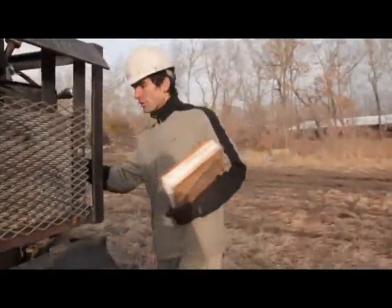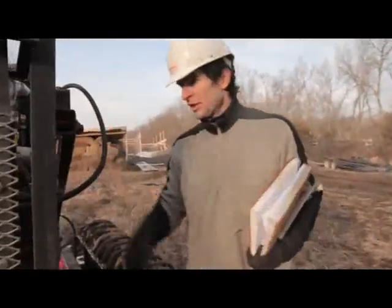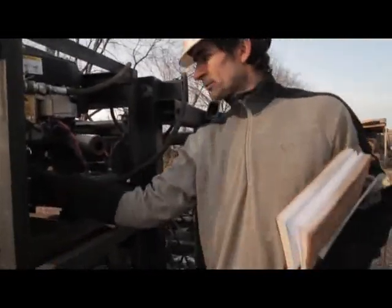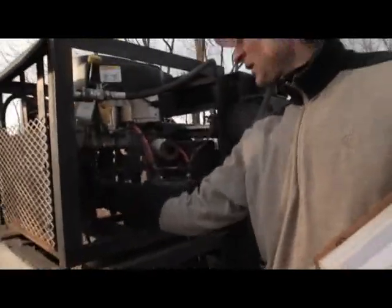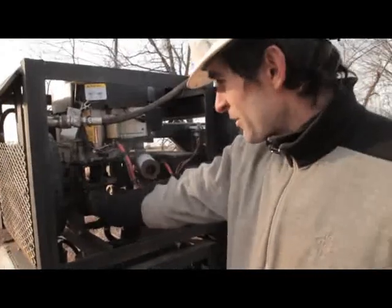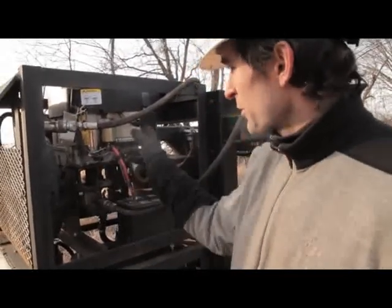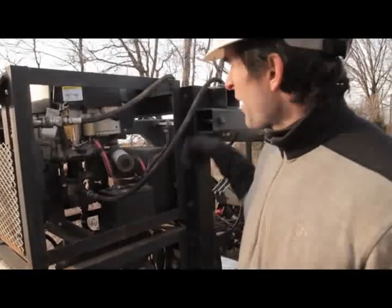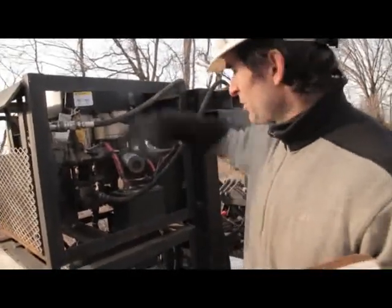Just to show you — look at the outlet on this side here. Here's the pump. This is the engine, this is the pump. This very small unit transfers 27 horsepower through flexible hoses to whatever device you have. And here's the return hose back into the system.